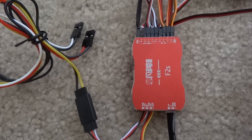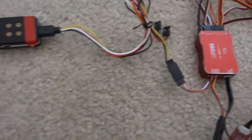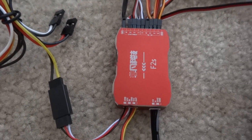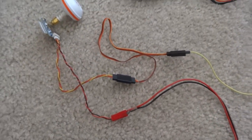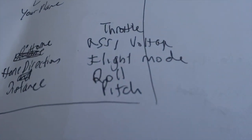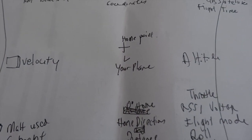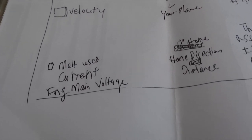What's special about this flight controller, the F2S, is it's an all-in-one plug-and-play. The camera is hooked up here and sends the video picture onto the flight controller. The on-screen display will transmit the data and the picture onto your FPV transmitter — that's your video transmitter. It shows you everything: the RSSI, the flight mode, distance from home, and even illustrates where you are in relation to the launch point with a little radar, plus velocity and voltage — all the important stuff.